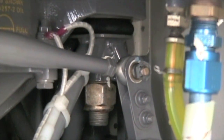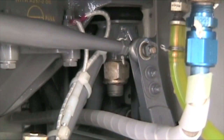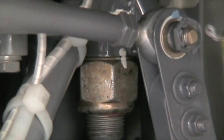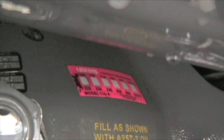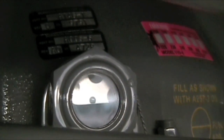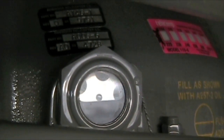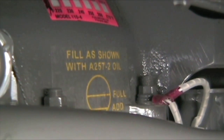There's one of four main rotor transmission mount bolts. Check the rubber — make sure it's dry and there's no oil. It may be a little wet from washing. Torque stripe is visible on the bolt, which is always good. Check the wires going to the main rotor transmission. There's your main rotor transmission TeleTemp — make sure it's not blackened all the way in, and take note of where it is after every flight. Here's the sight glass for the main rotor transmission gearbox — oil should be halfway up the sight glass. Check the diagram to confirm the add and full marks.